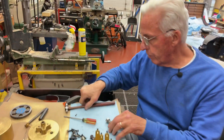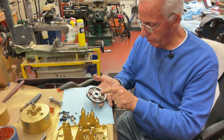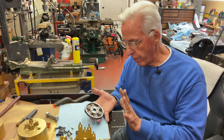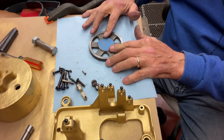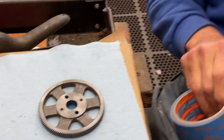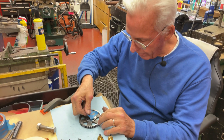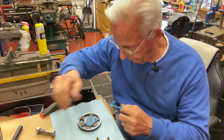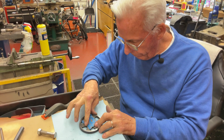Now we get to the gear on the spring barrel. You have this gear, and all of it is painted, but this piece here isn't painted and the side of the gear is not painted. So how do we repaint this? It's very easy — all you do is lay some blue painters tape on. I'm going to show you how to get that circle in the painters tape. Instead of using a razor blade, I go old school, like in the 50s — your dad probably had to make his own gaskets — so we put a little painters tape on here, cover everything up, then beat on it. You take that and round out the edge.